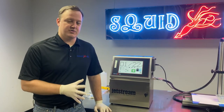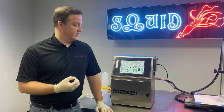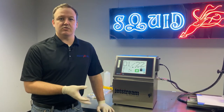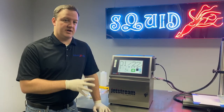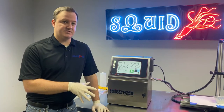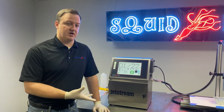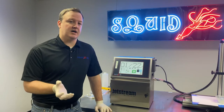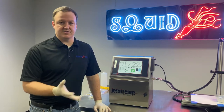The second scenario is just a standard PM. When the filter life has expired and we need to do a filter change and flush the machine out, we would also use cleaning for long-term shutdown. The third scenario is if we need to change ink types. That doesn't happen very often, but maybe you've decided you want a different color ink or an ink with different adhesion properties because you've changed products. We would use this process to clean the machine out in order to introduce the new fluids.